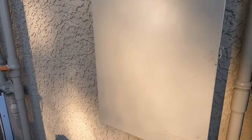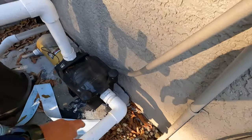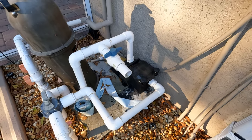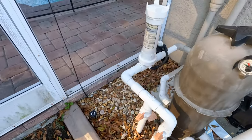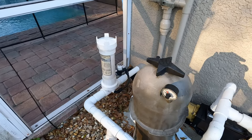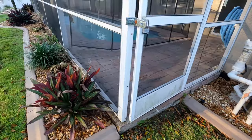This plumbing is not ideal for this pump - generally you want five times the diameter going in and out of the pump - but nothing we can do there and it is running well. No leaks at the chlorinator. And again, why someone is putting tablets in the skimmer when there's a chlorinator right here, I'm not really sure, but it's happening and we've got to report that. This is a very simple equipment pad.